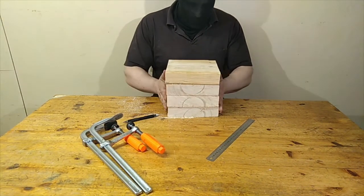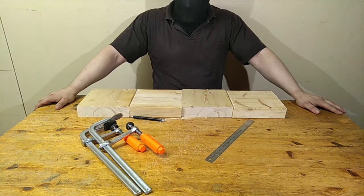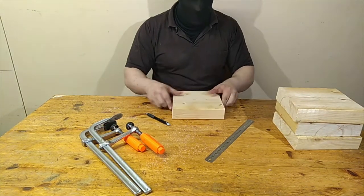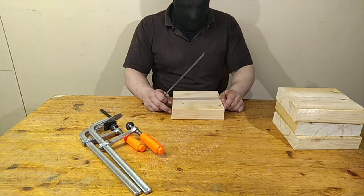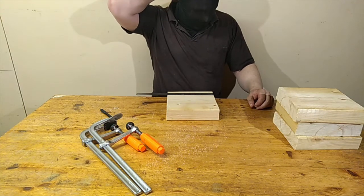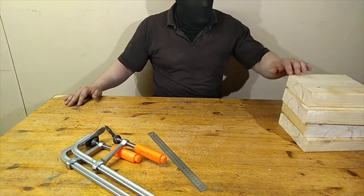Right, so we have our pieces now. The next thing is that we got even more. Now we got pieces from the plywood that are the same sizes as these. Again, you take the measurements from the board itself, since the 2x4 and 2x8 are not exact measurements. In my case, these 2x8s are really 7.75 inches. In other words, they are 19.5 centimeters. So I will cut now from the plywood 2 pieces that cover these sections.